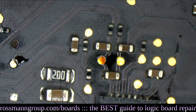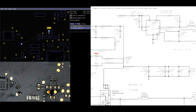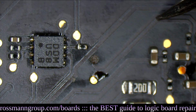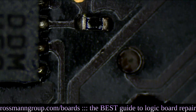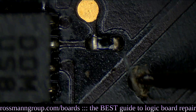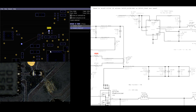If we follow along the line, it should be very obvious why this is broken. R7121 up here is going to attach to R7120 over here — and what's this? It's broken. Where this trace is supposed to go, there's nothing there. From here to here, there's nothing left. Can't even find a nub — it got burned out. It's expected that it burned out because this is a 16-volt line, which is high voltage compared to everything else in the machine. No wonder that probe point got burned.